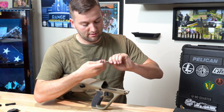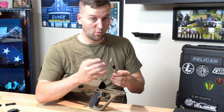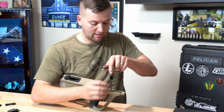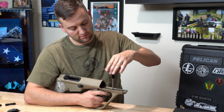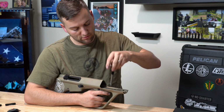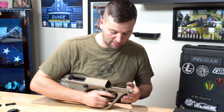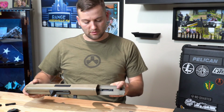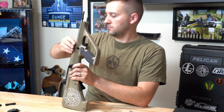Now we're going to go ahead and engage the last set screw. It is a 1/8 drive. And again, the thing we're trying to feel here is just when it touches the linkage, and you'll notice. Go in, boom, found it, another quarter turn. That's all we're doing. No torquing that guy down, at least not with a PLA plastic. So that's fully engaged. Let's go ahead and reassemble and do a function check.